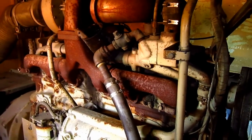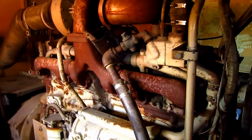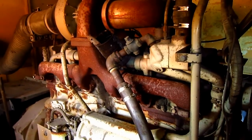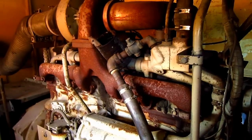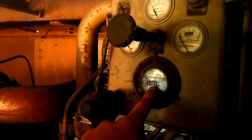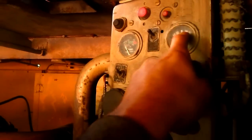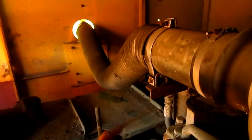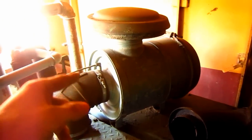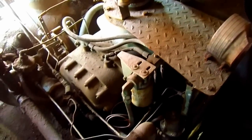The 40R was offered with either diesel or electric power, depending on what the customer preferred. As you can see, this particular 40R is diesel powered. The engine in the back here is a Cummins NT855 that produces 300 horsepower for the drill. An optional Caterpillar power was also offered for this machine. Here you can see all the gauges: the hour gauge — this has 14,895 hours on the engine — oil pressure, fuel pressure, amps, and all the buttons and controls to work the engine. Here you can see the pipe that pulls the fresh cleaned air from the air cleaner, which is mounted outside on the side of the house. This other air cleaner mounted inside the house is for the air compressor, which is mounted directly below it.